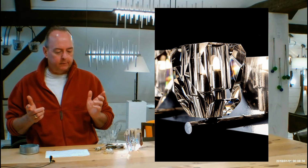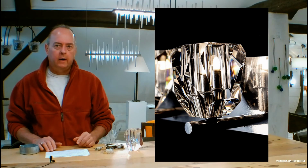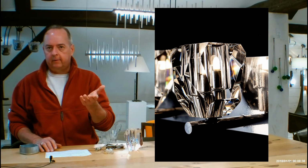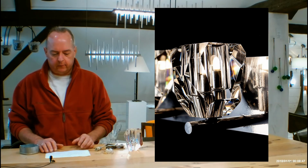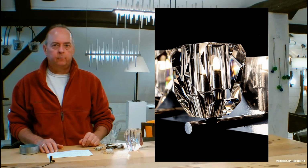So what I would probably do is go for a 3,000 Kelvin, let's say 60 watt equivalent, because remember you've got like 5 of these, so you don't have to go too crazy. And it's easier to find the 40 watts too, so that would be just as good. If you want to dim it, but at the same time a lot of people don't dim their bathroom lights. It's just one of those things. But again, very easy to find out there in any hardware store, so you're fine.